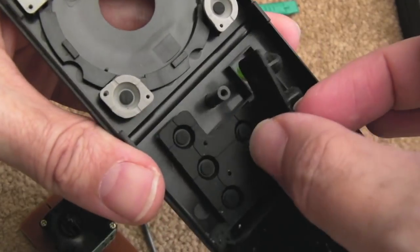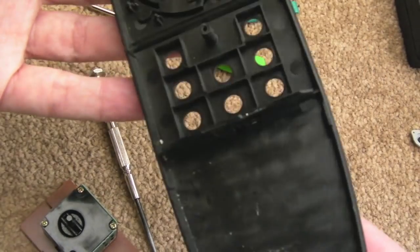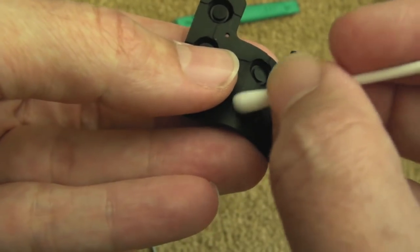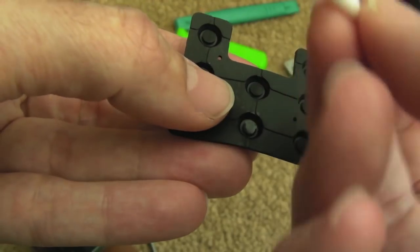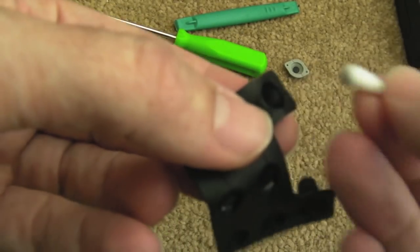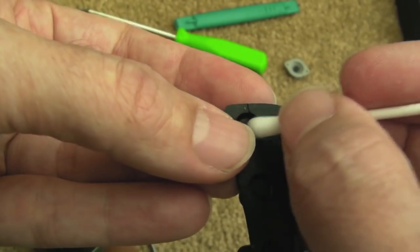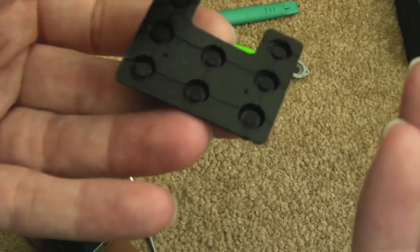If I heat this solder here and press down, we'll get that totally straight. So I think I'll do that. I'll pull these silicon bits out of here and clean those up as well, and then I'll just give this bit a wash in the sink to get all this dirt out. Just a little bit of IPA. All we're doing here is just evening the surface off. I have seen people on some videos trying to rub — you see the bit of black there — they've rubbed so hard because they think it's dirty, and the cotton buds go blacker and blacker. They're like, 'oh, look how dirty this is.' But the idea is to get as little of that black stuff removed as possible.